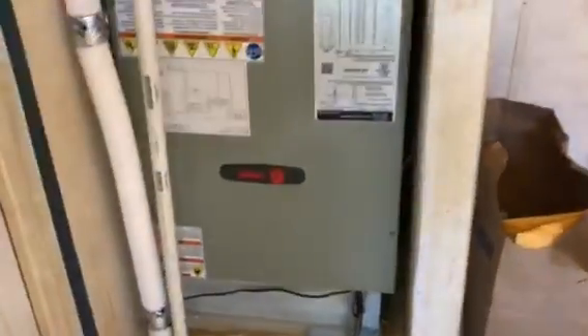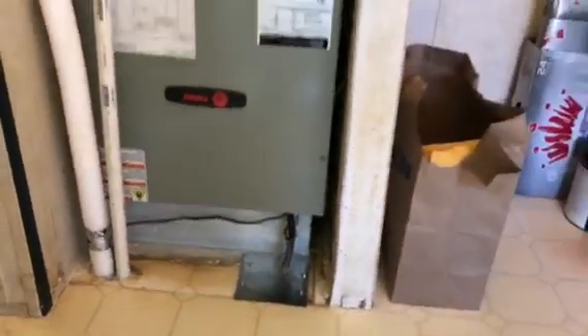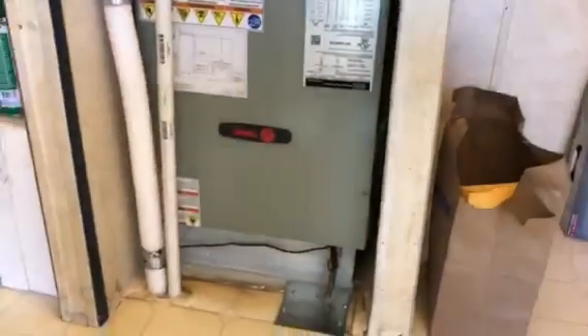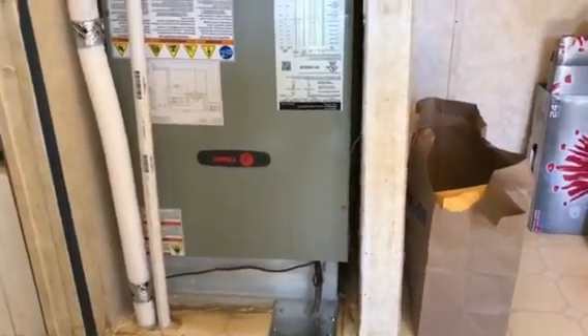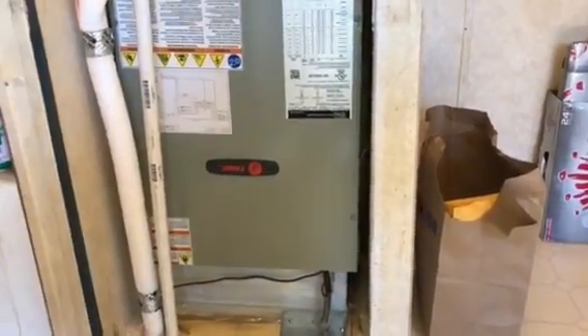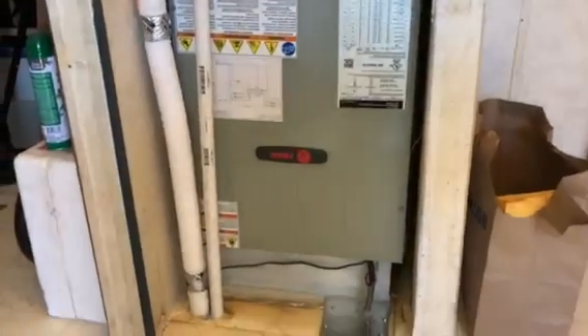We take the standard TEM air handler and make it a down flow. This white border right here is actually a treated two by six — we made a square, about 19 inch square frame, out of the treated two by six and mastic it to the floor. Let it sit up for a couple hours while we were doing other stuff.